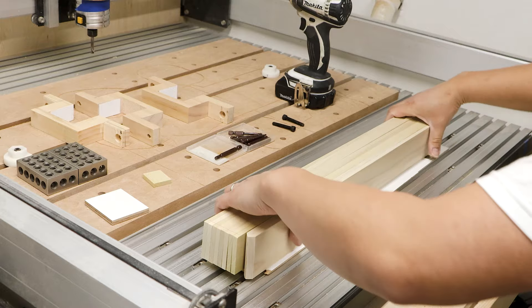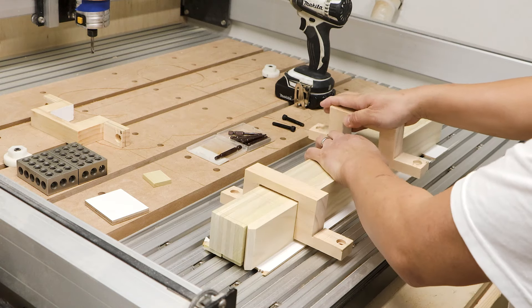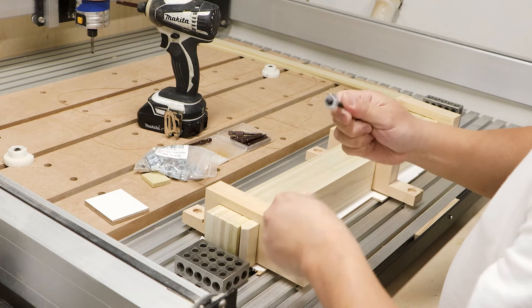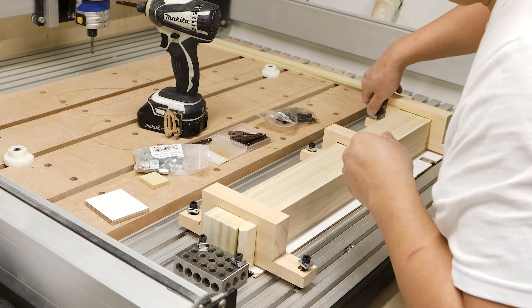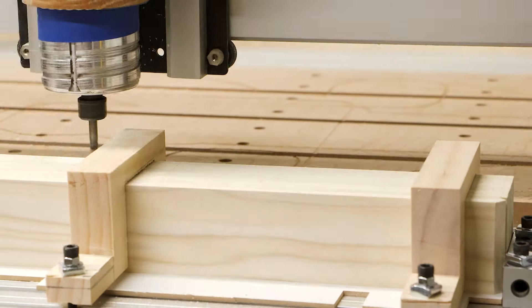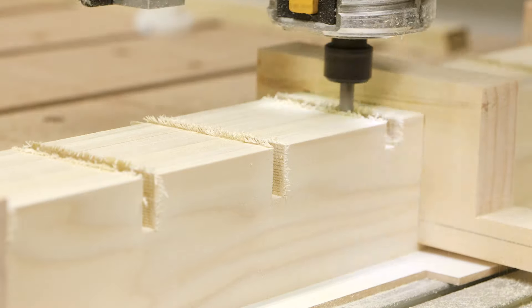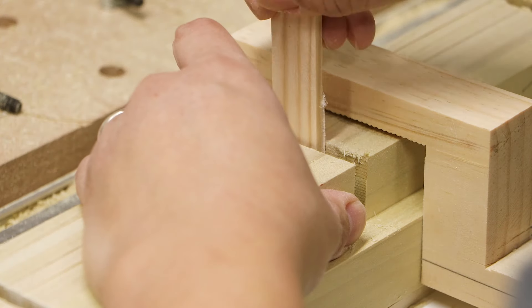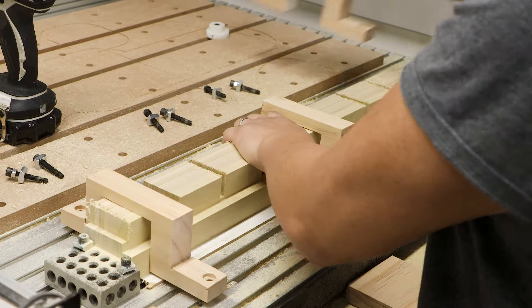I wanted to try something new — one big reason being that I didn't have a dado saw set. So I used my CNC machine to mill dado grooves which assemble into the slot grid. I had to stand the strips upright to vertically cut them square all at once, which called for top bracing and side mounts to restrict any movement. The strips were a quarter inch and I used a quarter-inch bit to mill the dados for a good friction-fit assembly. For extra security I CNC'd a final pass to shave off an extra half millimeter for a snugger clearance.